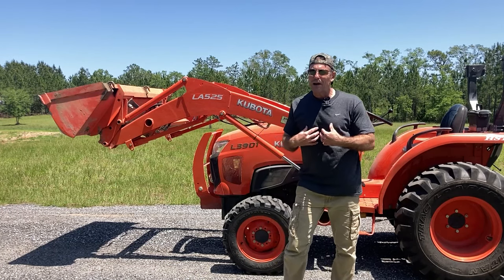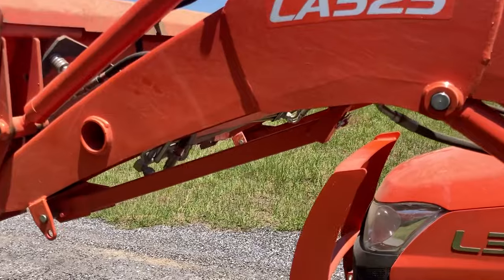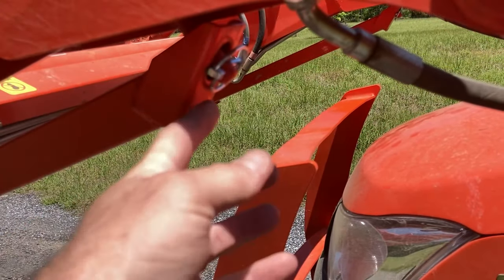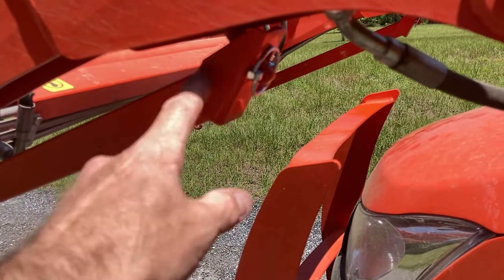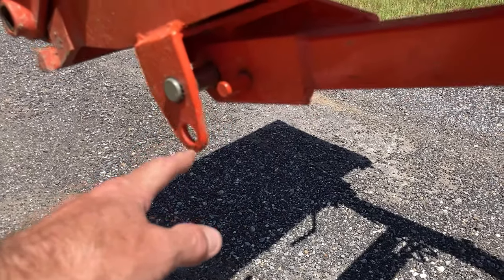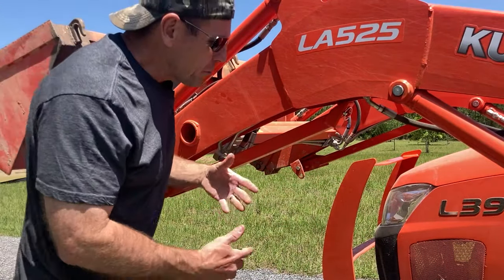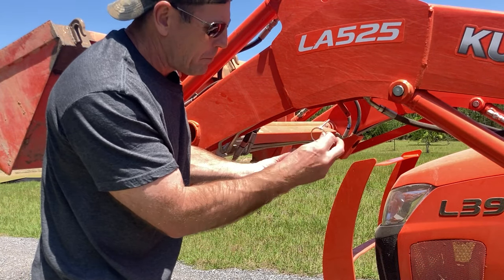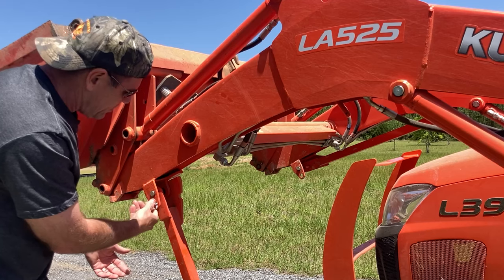You're probably wondering what this does — I know I did when I first bought a Kubota tractor years ago with a front end loader. I replaced the original push-pull pin with an actual snap pin. What this does is it comes down and this little knob goes into this hole to create the kickstand. Your loader has to be in the up position to do this.